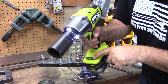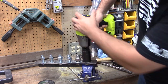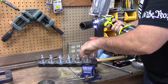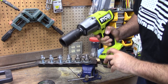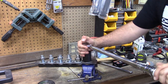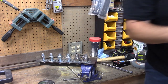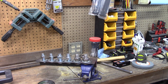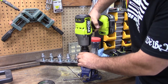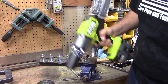For the first test, I set it on level three using a 6-amp hour HP battery — and it really did break it loose. Then I set it on level one with 250 pounds of torque on the bolt. Let's break it off — and wow, level one actually broke it loose too.